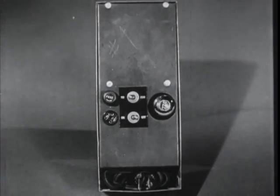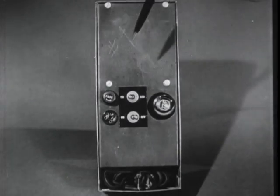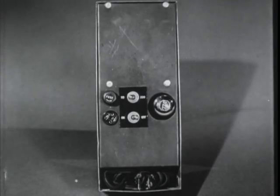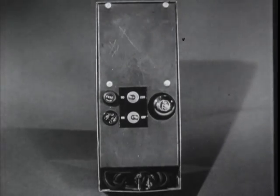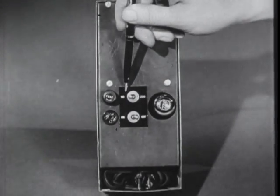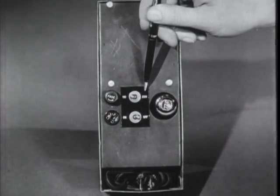This is the power supply that was concealed in the loaf of bread. It is designed for an alternating current of from 25 to 60 cycles and of 110 or 220 volts. The 110 and 220 are only approximate, as the unit will operate with as much as a 20 volt variation on either side of these markings.